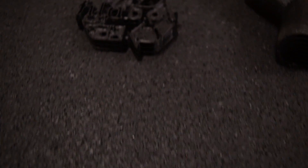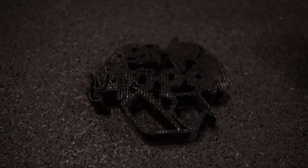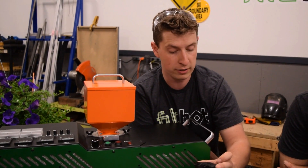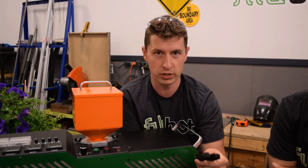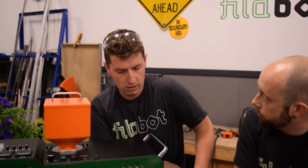High shrink rate. People who have worked with 3D printing know that warpage is a pain. You'll see at the bottom this print has a texture — this is actually from a Velcro sheet, the hook side, stuck to the bed and printed right on top of it. We realized we could have done a raft and printed the sample on it without getting that pattern, but the Velcro worked great. As we play with different materials with different warpage and we aren't sure what the actual grade is, we're going to need to play around with bed adhesion. If the bed sucks, the print's going to suck — at least the bottom layer, most likely the rest of it. There was a lot of warpage with this part.